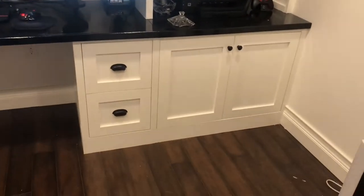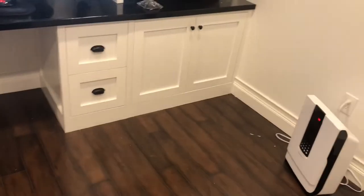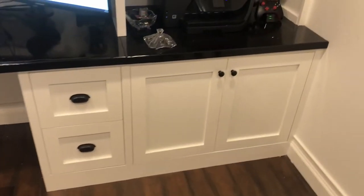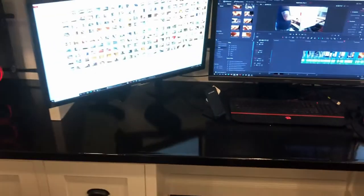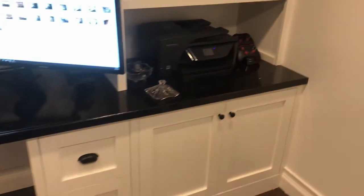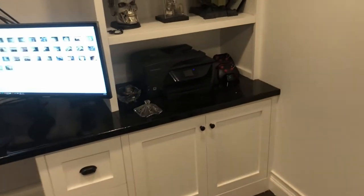Hardware, we went with Wayfair. They had just what we needed. And then of course, for the top, I do 3 coats of Polyshades along with 2 coats of a gloss polyurethane. I like oil base for desktops just because it's typically thicker. And as it dries, the polymer sets up over 30 days, and you get just a really nice finish as opposed to water base, in my opinion.